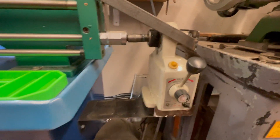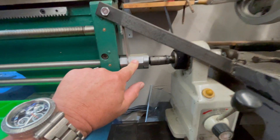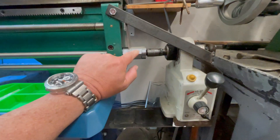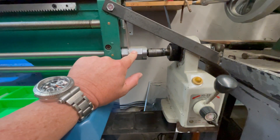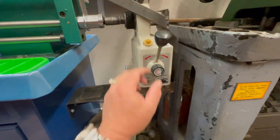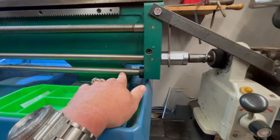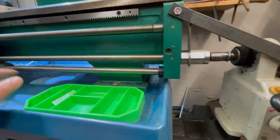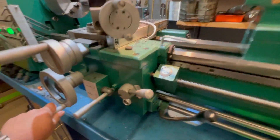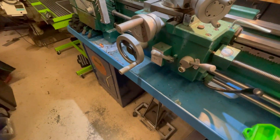I hooked this up to the feed on my lathe. It has the right gearing but I had to use a torque multiplier — I put it in backwards; it's normally for taking lugs off. I got it through JC Whitney cheap. It's got a 4.71 gear ratio, so when you turn this, you can see how fast it's spinning — it's almost five to one.